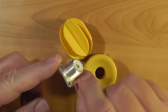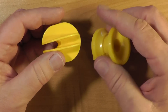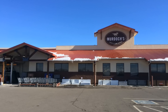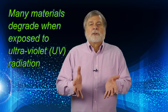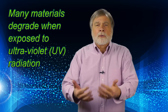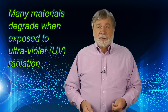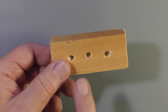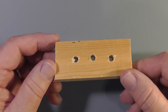You could also use a standard SO239 connector, and you can also use common materials for your center insulator. I use electric fence insulators such as these two shown here, both of which I got from Murdoch's, a farm and ranch store, where they're really inexpensive. You can make do with things around the home, such as a piece of PVC pipe with holes drilled in it — though PVC pipe is often not UV-resistant, so it will degrade with time. Here's a simple wood insulator I made just for this video, although this might be something you'd use for a temporary antenna or for testing a concept. The sunshine will eventually crack the wood. As you can see, you're only limited by your imagination.